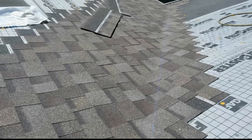And I hope you took note of that weird five nailing pattern I've been doing. Whenever I'm doing valleys, I get in the habit of that, because you never know exactly which shingle is going to need that back step. So it's best just to use that nail pattern the entire time. And then when it does come time to do that back step, you will never have a seam land right on one of those nails.